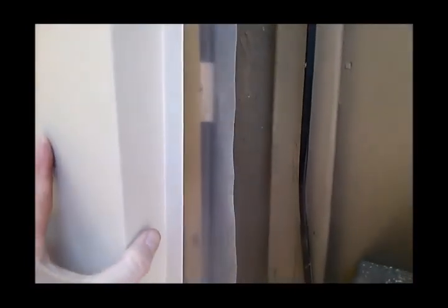If you're using pressure treated wood, it can't come into contact with the aluminum flashing, so we've put a 6 mil poly over this build out that's keeping the sunroom back wall plumb, and then when we put our beautiful cap over that, it won't deteriorate. The aluminum won't be affected by the chemicals in the PT.